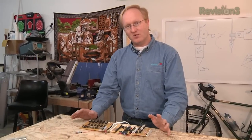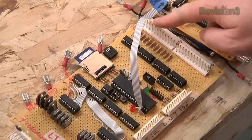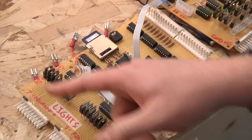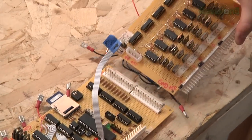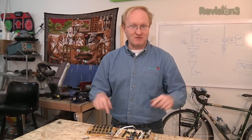Today on Bad News, I want to show you this new single-board parallax propeller-powered pinball system I'm working on. It has a parallax propeller, shift registers for cabinet switch inputs, matrix light outputs — up to 64 lights, and 64 switch inputs — plus a separate solenoid controller board which drives high-powered coils and pop bumpers. If this breadboard version works out, I can design it into a PCB and sell it to pinball enthusiasts so they can make their own pinball games.